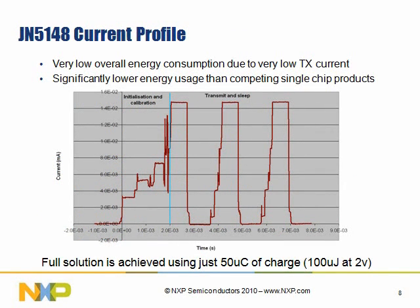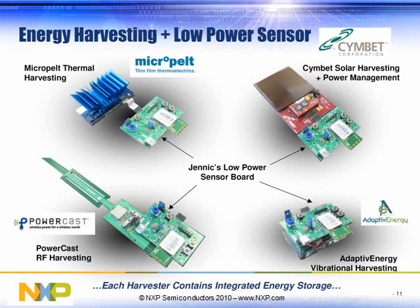This is what the current profile looks like. We are the only device that is Zigbee Green compliant because we never exceed 20 milliamps. The radio is designed in hardware, so there are no latency issues on interrupts with the microcontroller. We can gracefully start up the radio and never exceed the current specifications. The unit works by sending out three pulses — one of those three pulses would be received by the light fixture, and then it would act on that command, whether it's dimming or turning on or off.